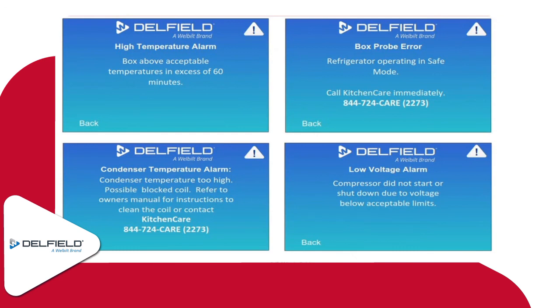These controls have a safe mode. If the air probe fails, it'll cycle the condensing unit on and off, like 8 minutes on, 4 minutes off, until we get that corrected. Condenser temperature alarm. I like this one because it shows the condenser temperature is too high, possible blocked coil. Refer to owner's manual to clean it or call our number. That one's nice because it puts a little bit of the ownership of the issue on the customer. They may not know where their manual is, but the phone number's right there. They can give me or any of the other people here at tech support a call, and we can walk them through how to clean the condenser coil.